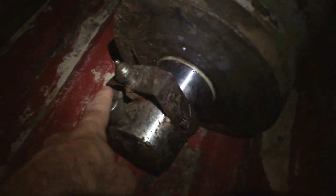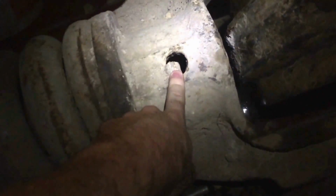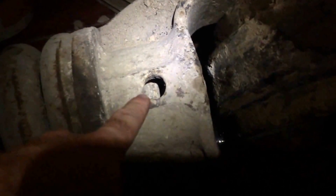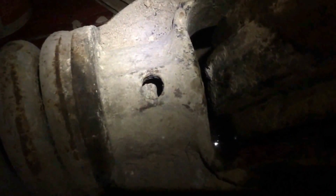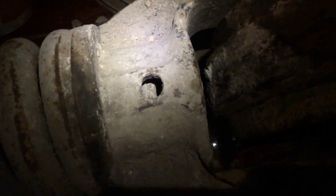Well, we figured it out. When this bolt is in and it's upright, it lines up perfectly with that eye that's right here in the yoke. Here, let me zoom in closer. This eye. Now you tell me, why does this eye exist in the yoke? We line it up with the threads that are in that bolt. You thread a lifting eye into there, and you stick a lifting eye in here with a nut on the back side, and then you can pick this thing up balanced and secure when you put the machine together. So when you think about it like that, it makes perfect sense.